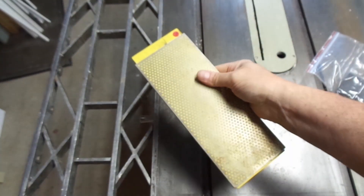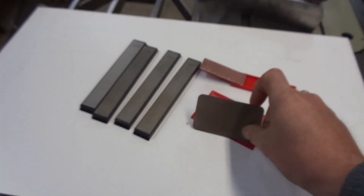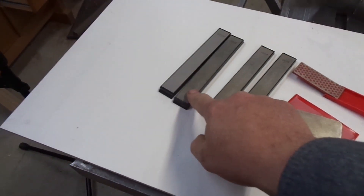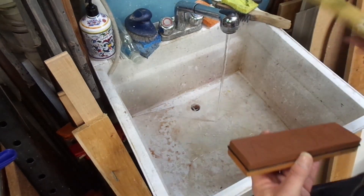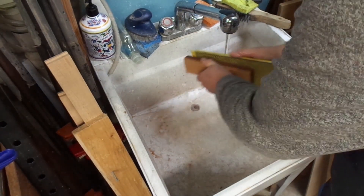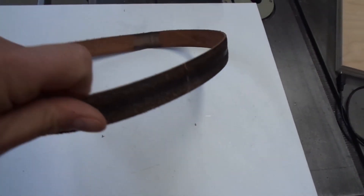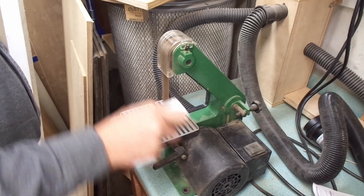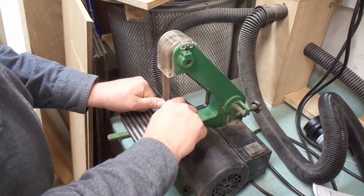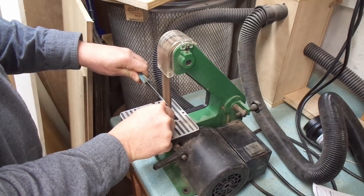At the top of the abrasive pyramid is diamond. Most people lubricate them — I use water on mine, but I don't think they have to be lubricated. They come in all different shapes and sizes, and for what they are, they tend to be expensive, especially the larger ones. The good news is they're very durable. At finer grits they're very good for honing, and at coarser grits they're very good for heavy material removal. I have one here that's fairly fine grit, and I use it to dress my water stone and occasionally to redefine an edge. An honorable mention goes to strops — typically made of leather or MDF loaded with a polishing compound — used to put a final polish on an edge. I have a leather belt on my belt sander that I use on knife blades, though not typically on my plane blades.